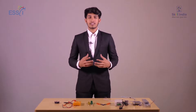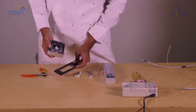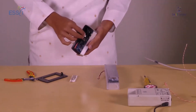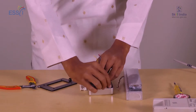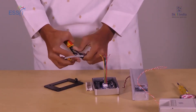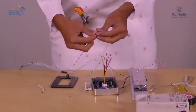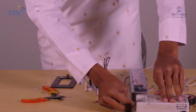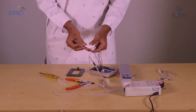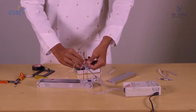We are going to see the installation of a standalone access control system with magnetic door lock and an exit switch. Behind the access control system there are two ports for connectors. We use a multi-strand wire to connect the access control to the power supply, EM lock, and exit switch. We peel the cable with a cutter or wire peeler. One pair of cable connects power supply and access control; another pair connects the exit switch and access control; the third pair connects the access control and the EM lock.